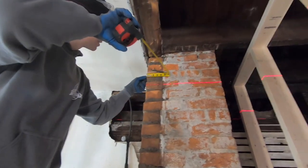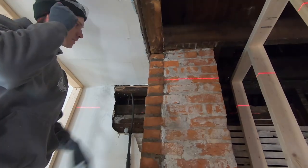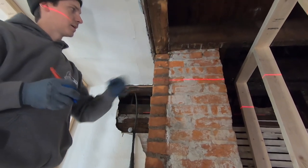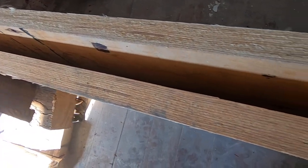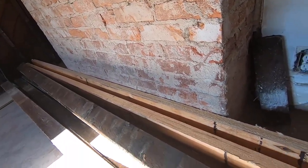We're going to take it out at four — just because that's the whole brick right there and it'll fit nice. This is a full one so we'll cut it in half, take this one out and leave the mortar. The LVL beams are an inch and three-quarter thick, nine and a quarter tall, and about twelve feet long.